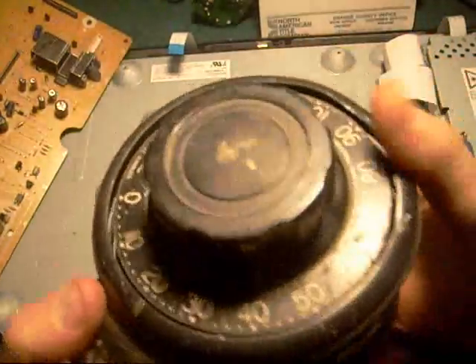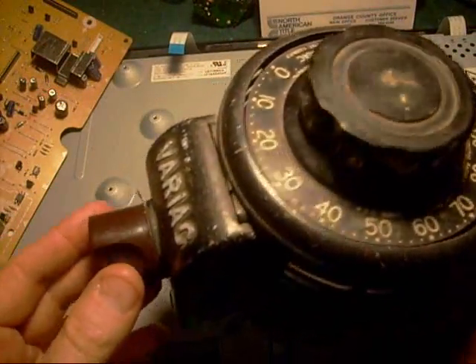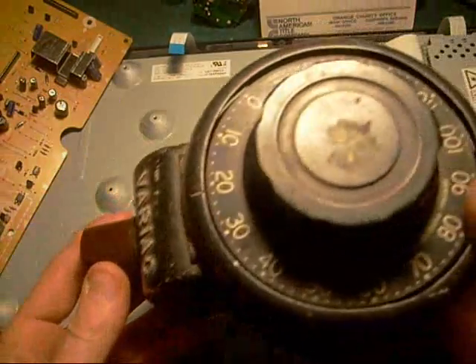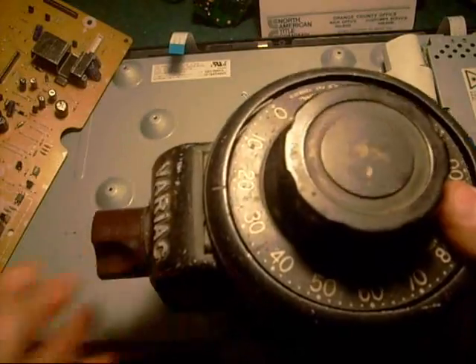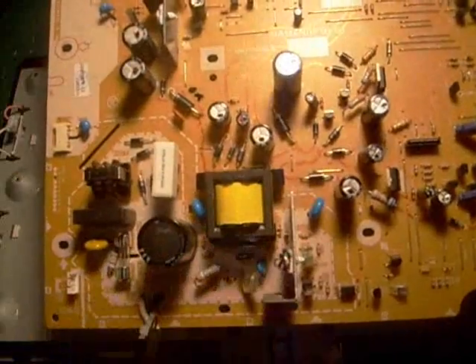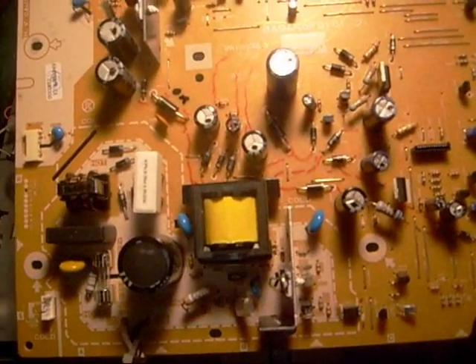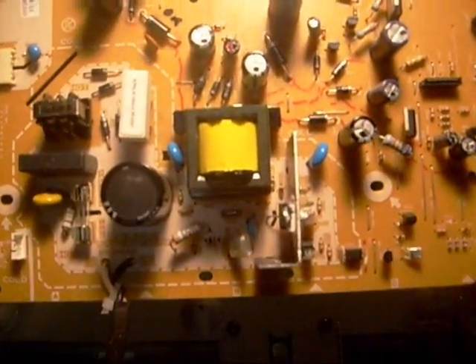What I did — even though I did lift the individual legs of the diodes — was use a rheostat and turn the voltage down going into the LCD TV to about 15 volts. Even with only 15 volts going in, that was enough to get this transformer oscillating a little bit. So it was enough to run some tests without taking the chance of blowing out a transistor on the primary side.